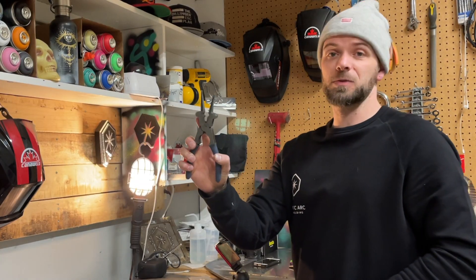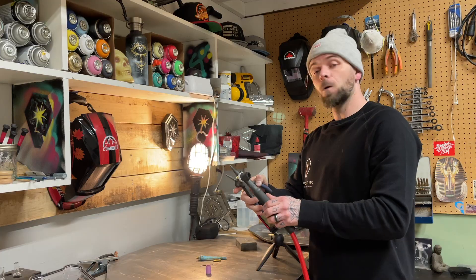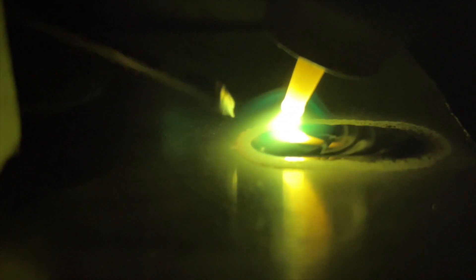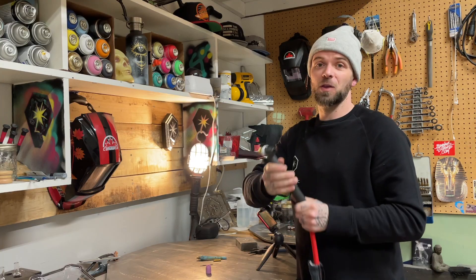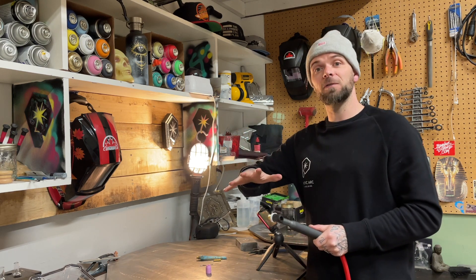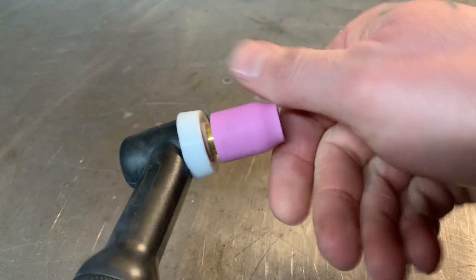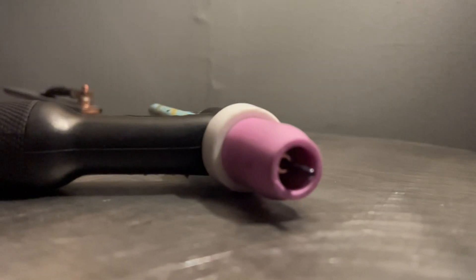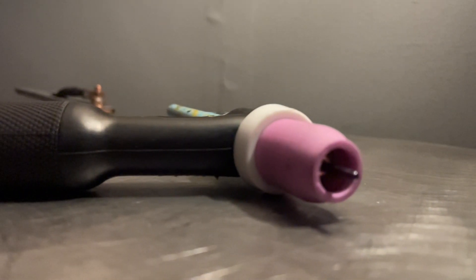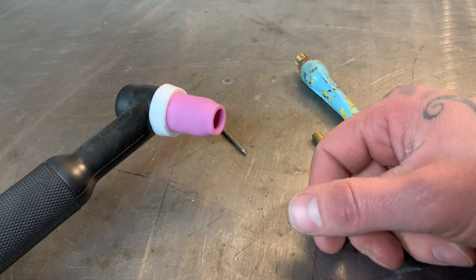I'm using basic welding pliers, or MIG pliers, whatever you want to call them. All you want to do when you tighten this up is just a little bit more than finger tight — that's it. You don't want to crush it down. What can happen is as the threads on the inside heat up when you start welding, if you have it tightened too much, the threads can start to warp because they're under pressure. So just a little bit more than finger tight and you're all good. Once this is firmly done up, I usually put my cup on and make sure it's seated correctly. This is a number six cup — the cup I pretty much use for most aluminum projects in this studio. Very basic, good to get you going when you're first learning.